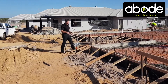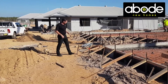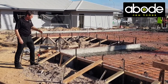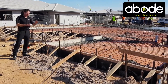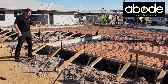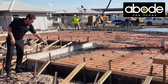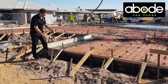Looking at another angle of how they set up the concrete slab. What they call the boxing is all set up to create the edge of the concrete. The boys use string lines where it's all been set up, and the house has been located where it's got to go. They string line through, then set their boxing up on top of that, giving us the exact size of the slab. They put in these star pickets to hold the boxing in place and adjust it with extra star pickets and timber.